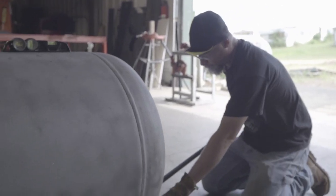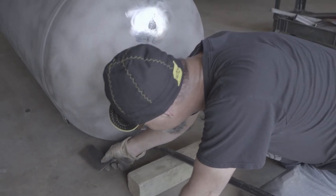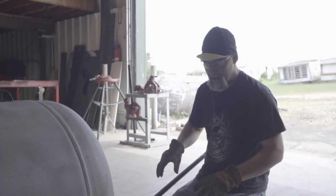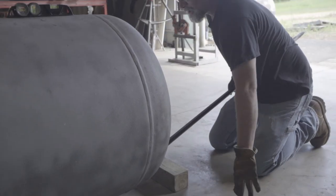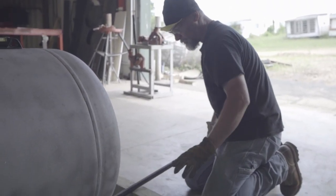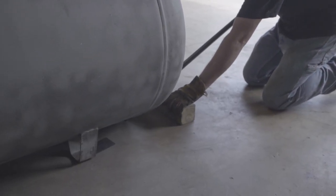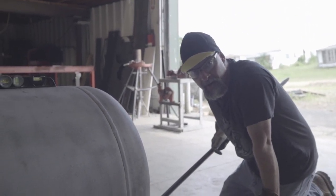I want to tell you real quick about prying things and moving heavy objects - that's something nobody hardly ever talks about. So when you're doing something like this by yourself in your garage and you don't have any help, you want to make sure and keep your digits out from underneath heavy things. I was reaching off to the side when I was sliding that in, and pushing way back on this bar as far as I could reach. If you put the bar way out here, you're going to have to push a lot harder. If you put this block way up here on the bar, then it's super easy to lift.